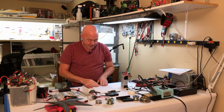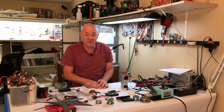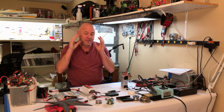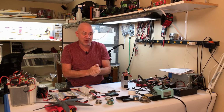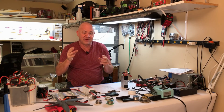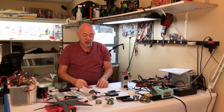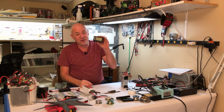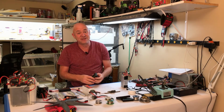But that's pretty much it, everybody, for this video. I just want everybody to understand that your charger most likely can check your internal resistance. Okay, if not, go to the flight test and watch their video on how to do the math and do the load testing. But if you really just want to kind of know if your battery's healthy, put it under load while watching the cells and see how much they dip.